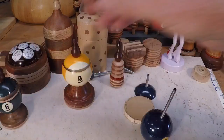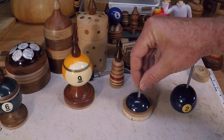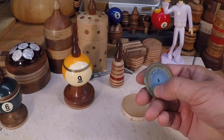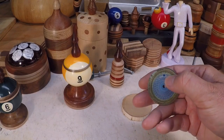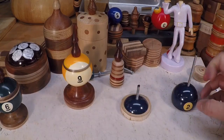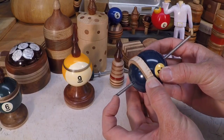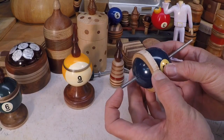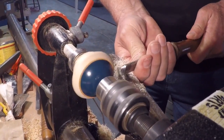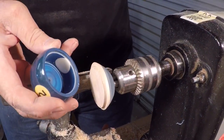I've got a little piece of maple — I like to have my colors contrast a little bit. I turned it down leaving it slightly concave so I could put my CA gel in there liberally, then stick it to the top of the lid. I'll put this in the lathe and cut it so it fits the bottom, cut the register, and put the two pieces together. Now I'm contouring my little spacer to fit.